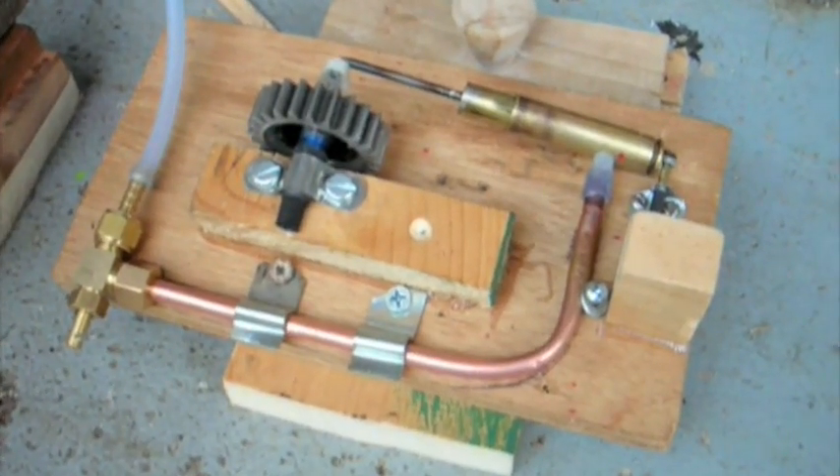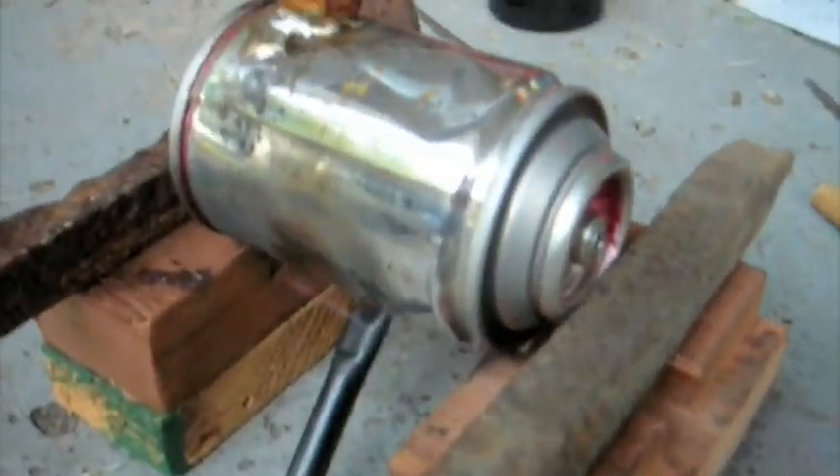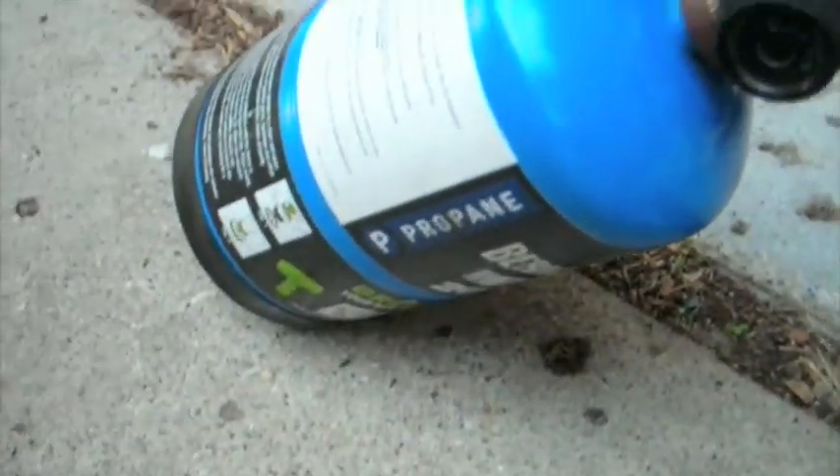Here's gonna be like the first test on my homemade steam engine. As you can see, it looks a little strange. There's a boiler made out of a mini spray can. Got my line from my propane tank. The railroad spikes in these are just to prop it up a little bit. Got the fire going right there. Got a sight glass made from a tube — it's up to about there.